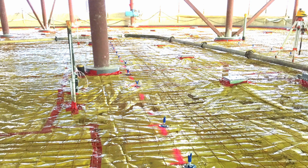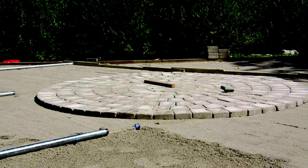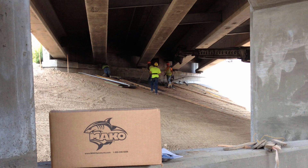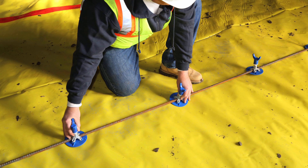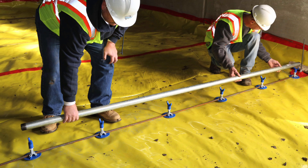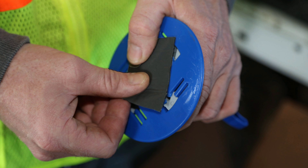The third setup combines the fin cap, fin stand, base plate, and driver. This setup is great when working with vapor barrier, concrete overlay, sand or rock subgrade, as well as elevated decks, slope slabs, plus abutments and embankments. We recommend adding rebar through the fin stand for fast and easy setup. The rebar also provides more stability to the setup. Some contractors prefer to keep the rebar in the system while others take it out. Another option when working with vapor barrier is to use double-sided adhesive between the base plate and the vapor barrier.